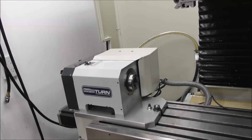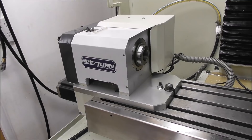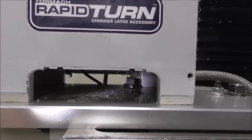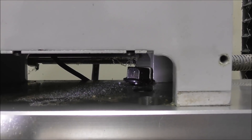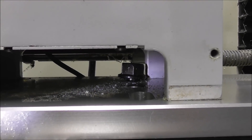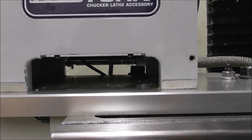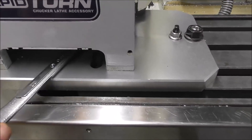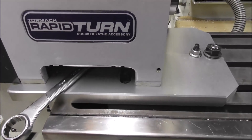Because Rapid Turn is aluminium, it's quite an easy lift — I'm not particularly strong and it's quite easy to lift that on there. It is a bit of a pain engaging a T-nut down in there. See that T-nut? It's a really awkward position and you can't get a spanner on it very easily because it's adjacent to a casting web. So if you're planning to take it on and off regularly, you'd want to re-engineer that part. You can just get at it with a 22mm open-end spanner, doing a little bit of a turn at a time, flipping it over and slowly tightening it up. It's not ideal but it works.